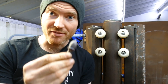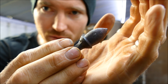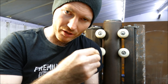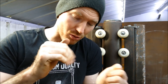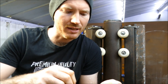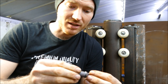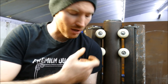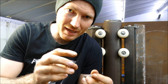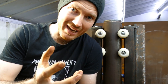These are coming out absolutely fantastic. If you want to take a closer look, see the smoothness and the definition - that is really lovely. These are now going to be available on my Etsy shop. It's worth noting though: wire brush it before putting it into the final die so you don't forge any of the scale back into itself making the surface rough. You can also spray a little bit of water into the die - as the die closes, it creates steam pressure and blows all the scale away, which keeps everything nice and clean. You can also use the airline to toot out any loose scale in the die. There are also graphite pastes you can rub onto the dies prior to using, which keeps it lubricated and helps protect the die from wear.